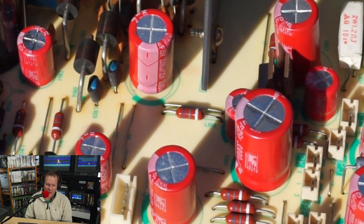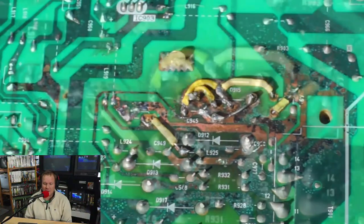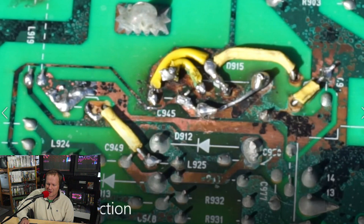After replacing the capacitors, here's what it looks like inside — it looks wonderful, cleaned up nicely. I want to show you how I repaired the sections on the back. In this particular area I had to make a jumper — most likely using a capacitor leg through the hole with a heat shrink tube on it — and then a couple of jumper wires where I had to rebuild entire traces that had been disintegrated by years of electrolytic fluid eating them away. There's another jumper there; I left the original jumper that was already installed in place and worked around it.